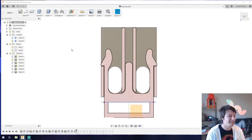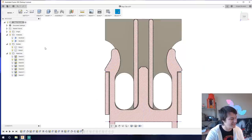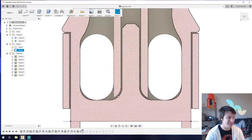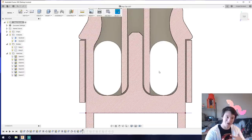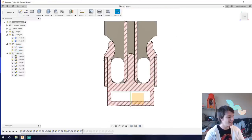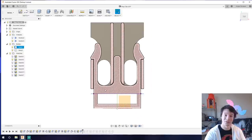Turning on the section analysis again, we've got a great buckle, but you need to get your fingers in to release it. I added circular cutaways where the prongs are, allowing you to get your fingers in from both sides to release it. At this point the buckle works perfectly — it goes in, deforms, there's enough room to deform, and once in place the prong is stopped by the posts so it won't go too far. To release, you squeeze it, it deforms again, and you pull it out.